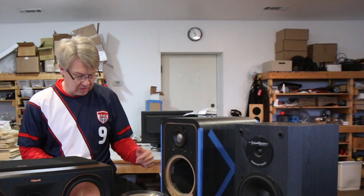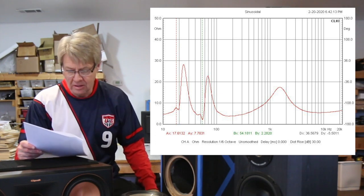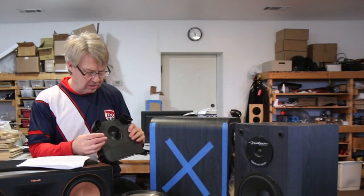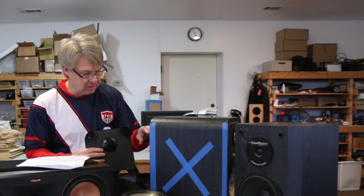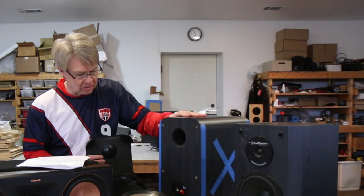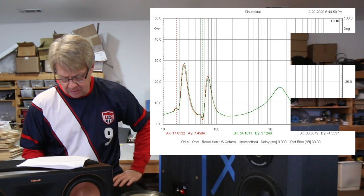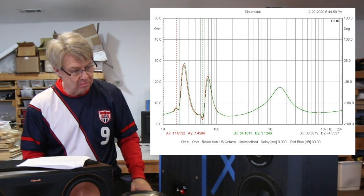The one issue I had was in the impedance curve — there's a pretty aggressive dip just above the tuning frequency, dropping to 2.2 ohms. A lot of it is caused by this little piece on the back: it's a pointed protrusion that faces straight into the port, meant to deflect output to the sides so you can place the speaker close to a wall and minimize port gain. But port output at those frequencies is omnidirectional anyway. Removing it brought that dip up almost a full ohm to 3.1 ohms.